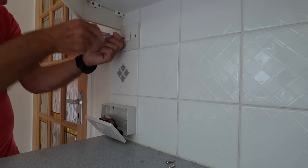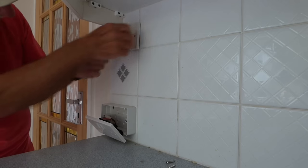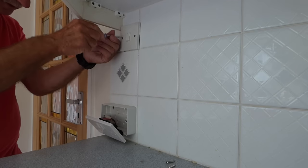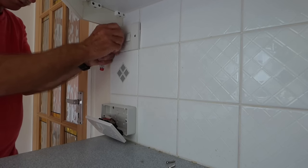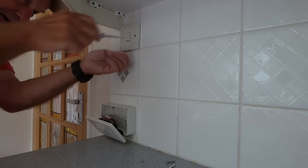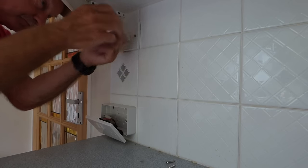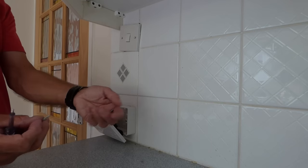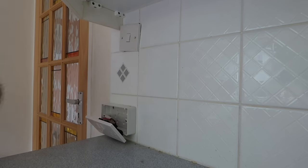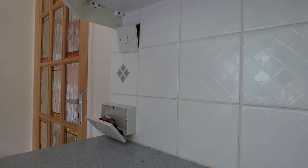Same with the light switch up top — this one you can just leave loose if the tiles come away okay; if not, take it right away again. Make sure the power is off. Make sure you've got the right screws sorted: long ones for the light switch, short ones for the little plug. Keep them safely away.